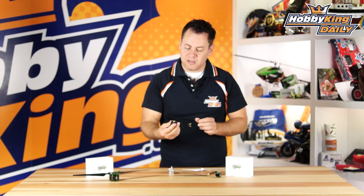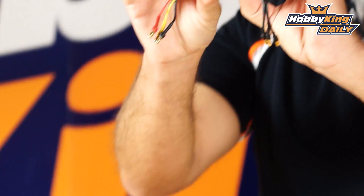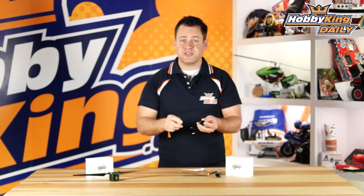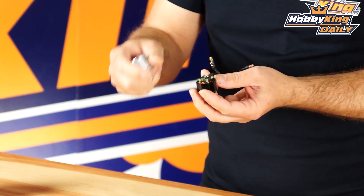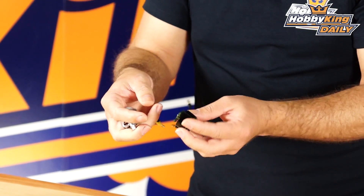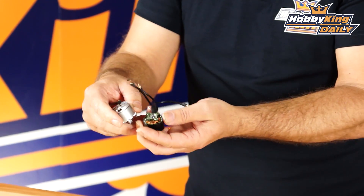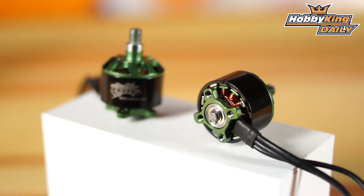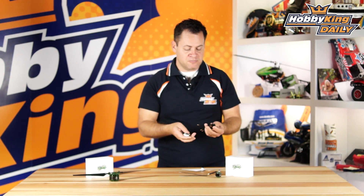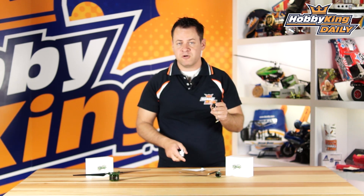One other thing to note on the motor itself — it doesn't enclose the lower mounting. It's identical as far as the bell and the distance from the mounting on the bottom to the top of the motor, but it doesn't wrap the aluminum all the way to the bottom. The reason is that some frame applications have clearance issues, so we decided to eliminate that and mimic the new standard of opening the lower bell, allowing tighter housing in those frames. It also exposes the absolutely pristine, beautiful windings on this motor. Multistar Elites — best motors you can get. The build quality difference between the standard 22-12 and the Multistar Elite line is clear, and the value on these motors is absolutely unbelievable.